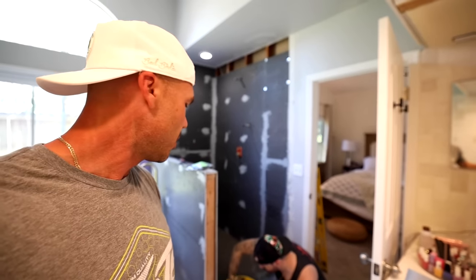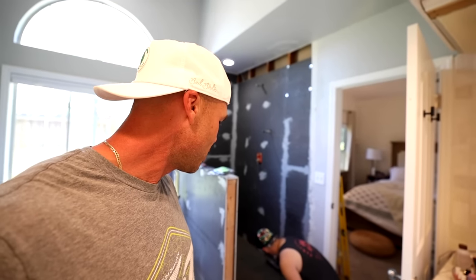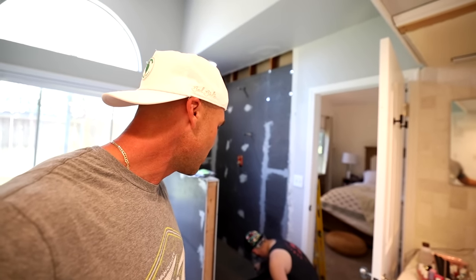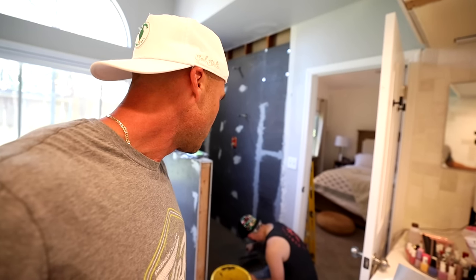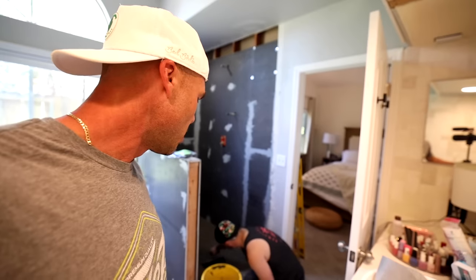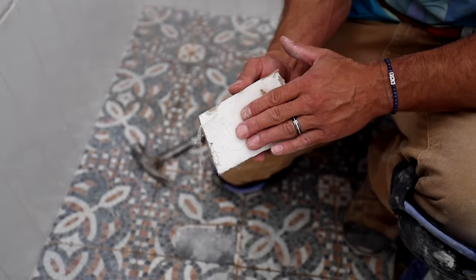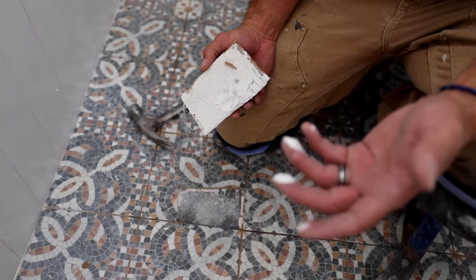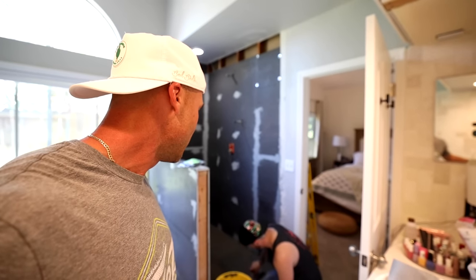All right, so Eric's doing a great job here, man. He's watched my videos on troweling and really applying the information correctly. I do make it look a lot easier in the videos, so don't get discouraged if you try it. I mean, practice makes perfect. So I wanted to get him on the troweling because he's going to be tiling the rest of the shower, so he's definitely going to need some practice with troweling thin set. Because before, what he used was mastic. He used mastic in this entire shower, so you don't have to mix it. And mastic and thin set just act a lot differently. So it's good that he's getting this practice with thin set, and he's doing a great job.